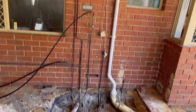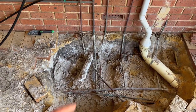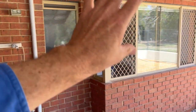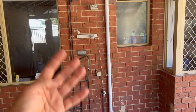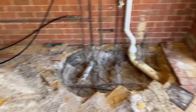We've done as much as we can today. We figured out a lot of stuff, which is great - we know exactly where all the pipes are. That black pipe was a mystery but we can just cut that off. We found the water main, the gas main, everything, and it all kind of makes sense. We know the cold main is flowing this way. Now we need to get the hot water system on the wall so we can chase all these pipes in, because this window is getting made smaller. Breno is going to plaster all this wall to sort of match it, so we can go to town chasing all the pipes in the wall with no exposure. Then we'll put the manifold system in there too to run the two showers and the other shower as well.